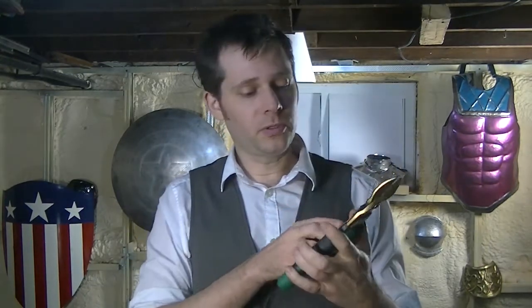As far as cutting goes, there's no magical technique. It's just like using scissors. The only thing to watch out for is that these shears have a specific direction. Most shears are designed to cut one way or the other way. And these ones are designed to cut into right-hand curves. So the entire cut that I'm going to make, I want to follow around along the right-hand curve and never have to do a left-hand curve.